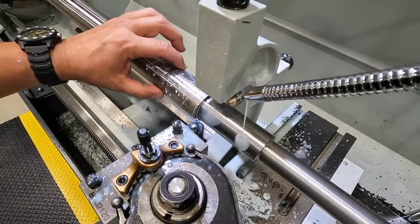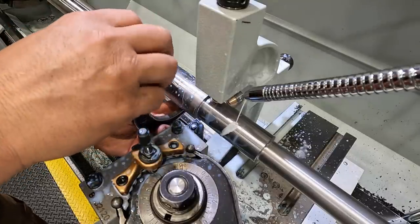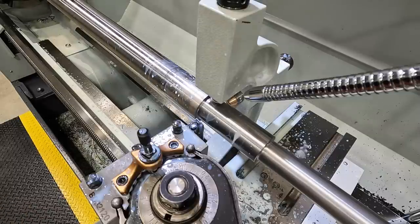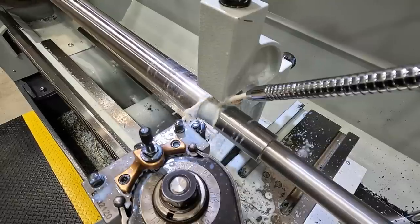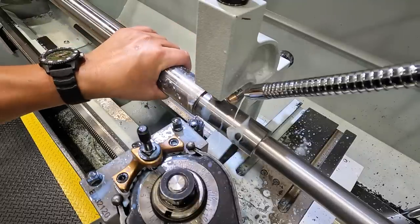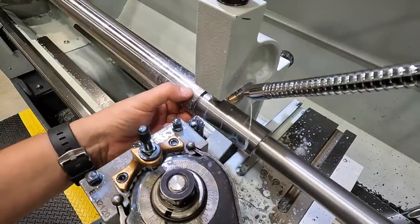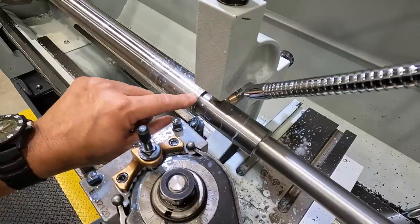This section was still larger, so I need to measure it — I want to make sure we don't take it down too small. I left it about 30 over, and we're still at 33. I'll do another 10 here and see what happens. That's exactly what I'm talking about — you've got to be able to support the shaft. Vibrating all over the place. These fingers have to be before the cut. As long as you have a nice true section, you can come in with your follow rest before you start making a cut. That way you don't have these problems.